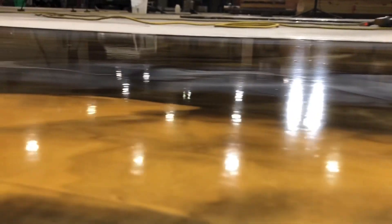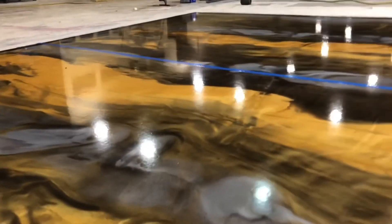Comparing all three products, the personal preference is the water-based urethane, simply because the odor wasn't bad, it's easy to apply without roller marks, and it is only a semi-gloss. When it comes to achieving a high gloss on a floor, the challenges that presents make it almost better to consider putting a wax coating down, which is easy to bring to a flawless condition — as long as the floor owner understands the maintenance requirements of a waxed floor.